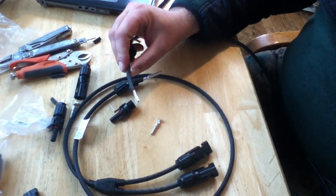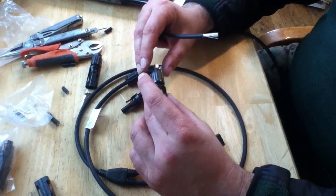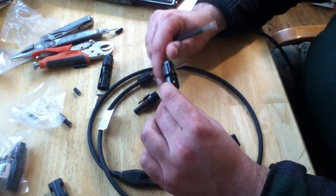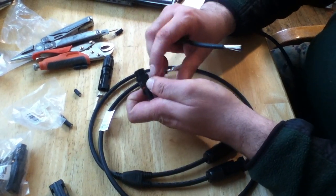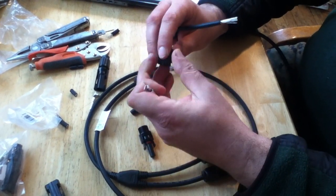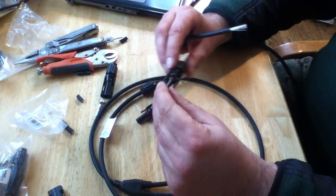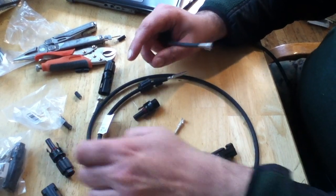What you would do is use a common wire crimping and stripping tool to strip back the insulation roughly an inch or so. On an MC4 connector it's actually kind of complex. They're mostly standardized industry-wide among different makers but not fully. Parts that are going to be different are the little twisty knobs and the sealer things on the inside, which pinch down around the cable as the connector gets tightened to hopefully create a waterproof seal.